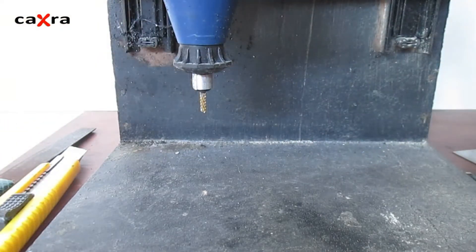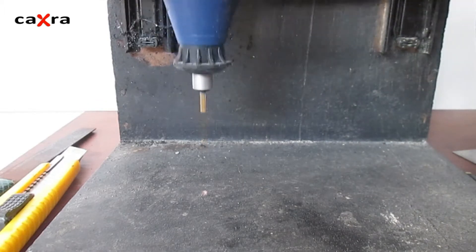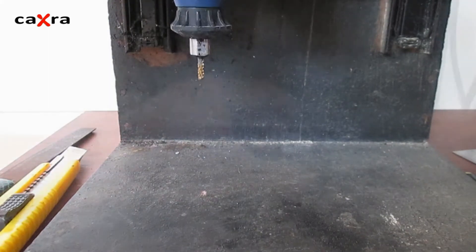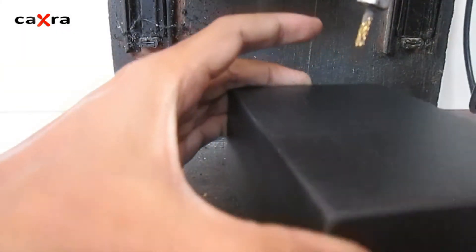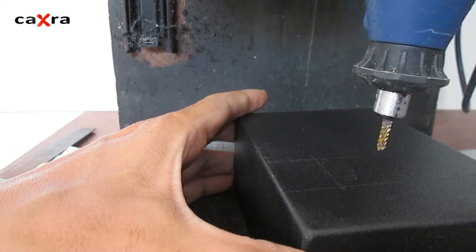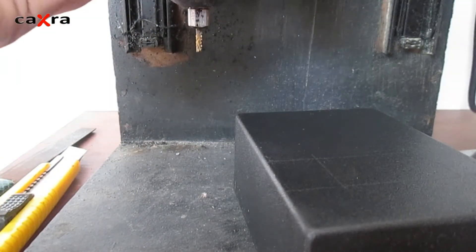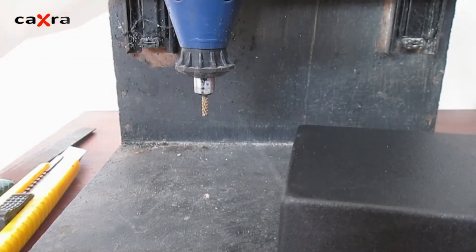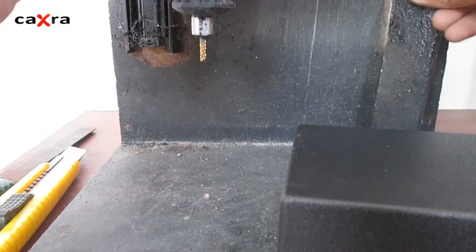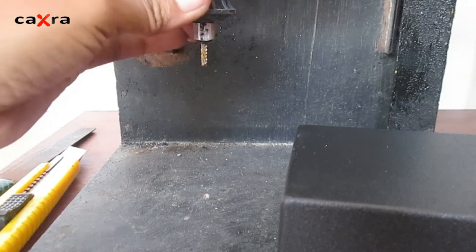This is the drill I usually use to drill PCBs. I usually use it up and down like this. Initially I drilled by moving the drill around the area to be drilled, but this method is not only troublesome but also difficult to make neat holes. So I tricked this drill into being still — not moving. The important thing is that the drill does not wiggle when used.